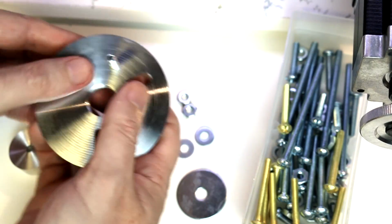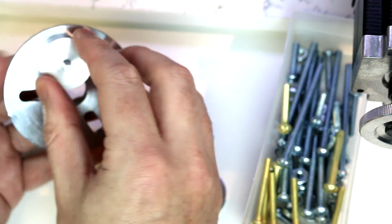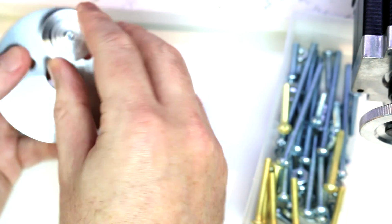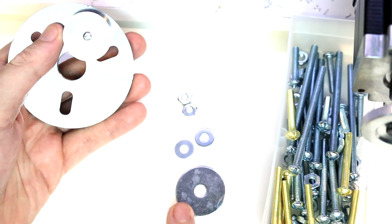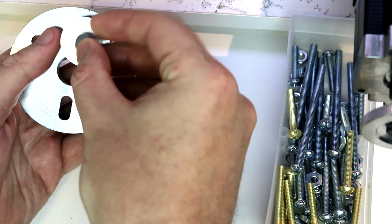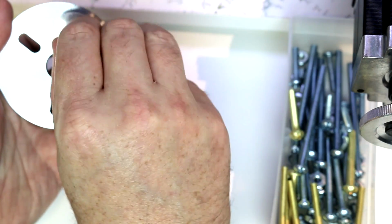I'm just going to take a 1-inch screw, put it through the faceplate, slide our workpiece on there, whichever side we want to do some modifications on. Now you can use fender washers and larger applications, lock washers, whatever you feel will help secure the piece on there.